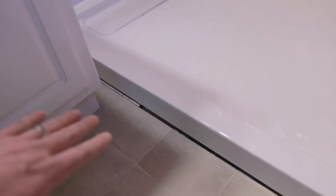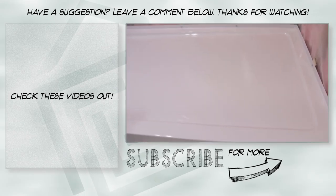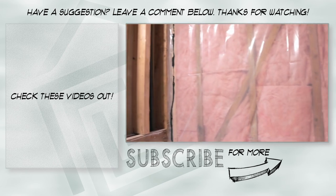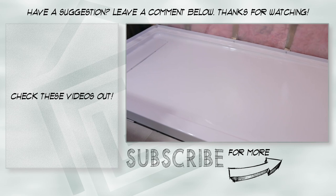The shower base is finally in — everything looks good, it's nice and solid. It was worth ripping that up and doing the concrete again. You can see at the bottom it's flush on this side, but as you go down there's a bit of a gap — the floor was lower over there, so I'll cover that with a piece of trim. Eventually when the floor gets done you can put leveling concrete on there to bring it up. Next up is the plumbing and tile, and then moving on to putting the shower door in. If you want to follow along, hit subscribe and we'll see you in the next video.